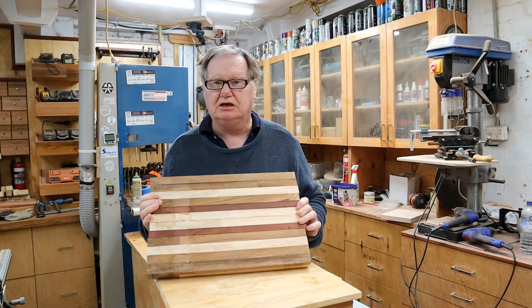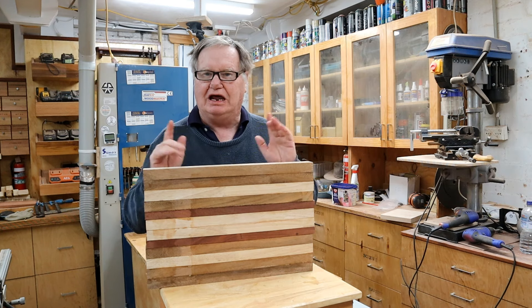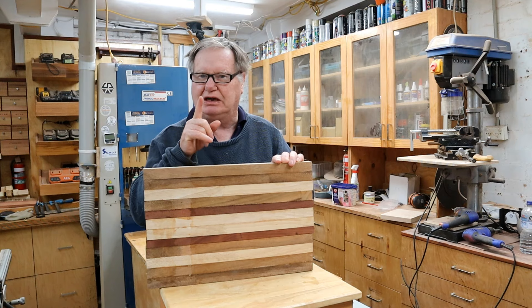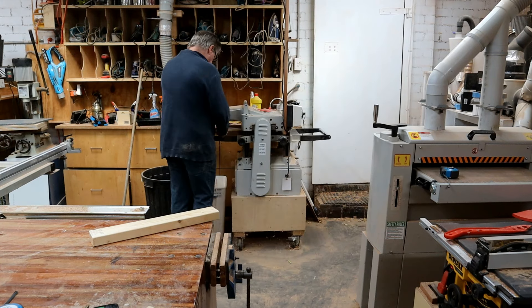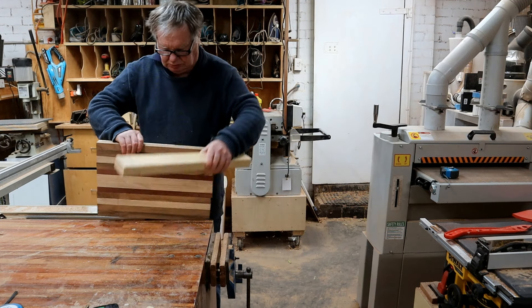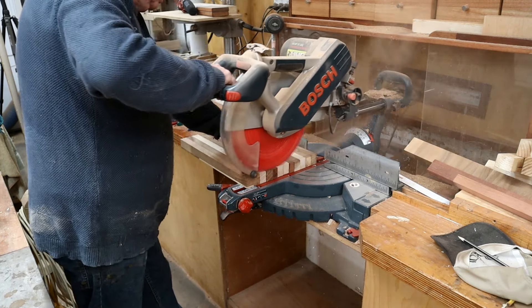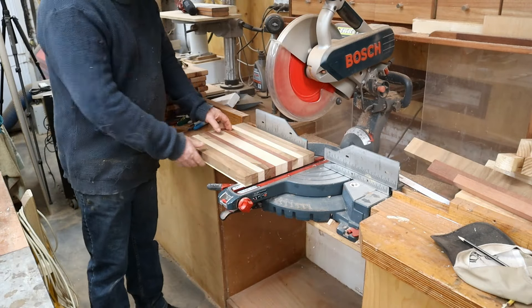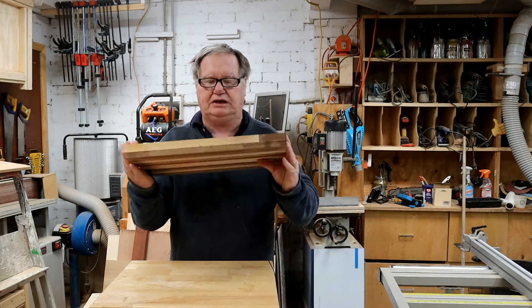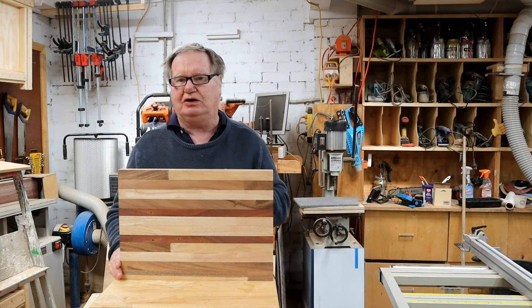Got the board out of the cramps now. We're just running it through the planer now - the planer is down to 35mm. We'll trim the ends up and then it's just a normal square board, and then it's time to make the swing jig. It comes back well done through the planer, looks really nice. We're checking the thickness. I cut it to 420mm - that's the size I cut my cutting boards at. I got it down to 35mm without using a tape measure - just used a bit of 35mm pine. That's what we're going to make our swing jig out of.